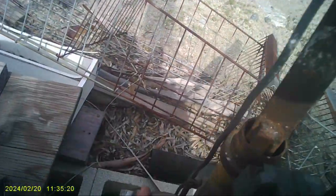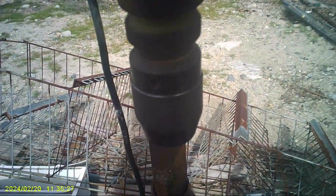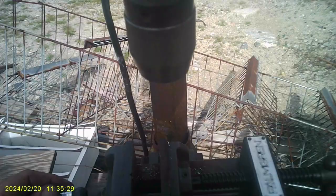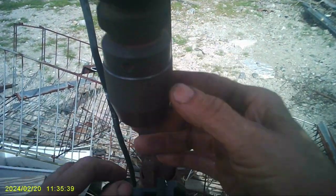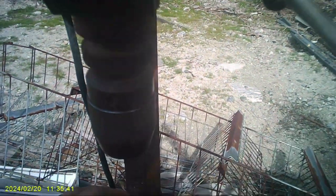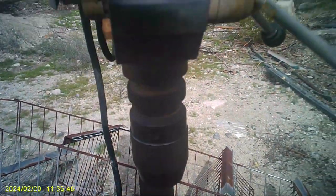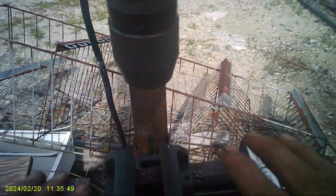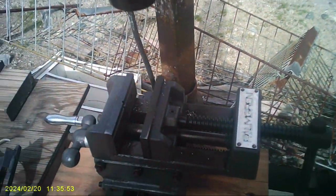When I do it, I'm going to have to probably lock this down as well so that this stays. I'm going to use my 16th-inch drill to locate the hole. I'm going to leave everything the same, take out the 16th, put in the mill bit, and hopefully that'll be centered the same way. This whole thing doesn't matter if it moves as long as the relationship stays the same.